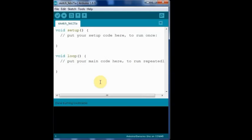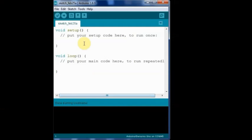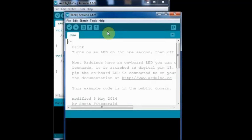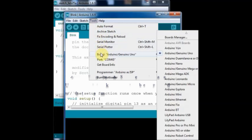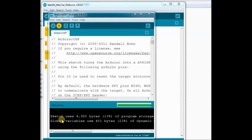After a few seconds you can see the serial LED flickering on both boards. Now the slave IC is bootloaded. Let us check it by uploading the blink sketch. Open the blink sketch from examples and then click Upload. Leave the settings as they are — you need not change anything. The blink sketch is uploaded and you can see the D13 LED blinking on the slave as well as on the master. As both the target and master are UNO, you can just upload any sketch with the same setup.